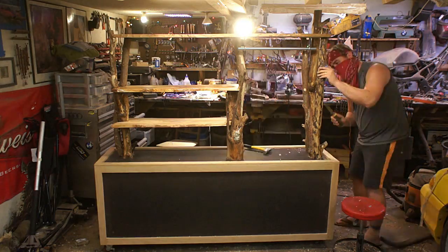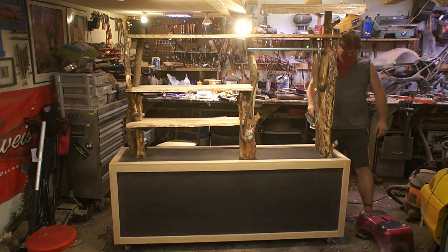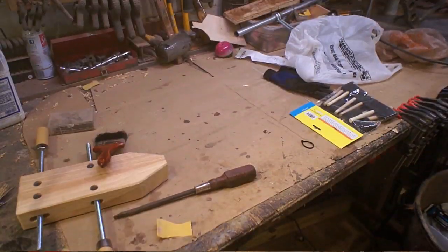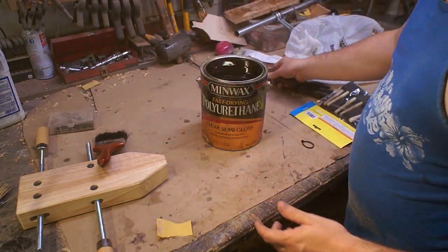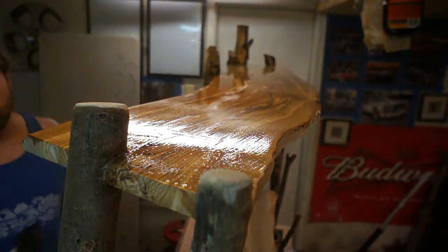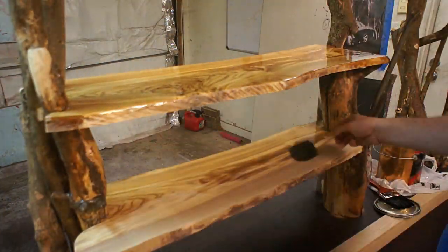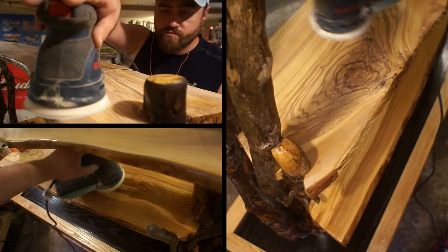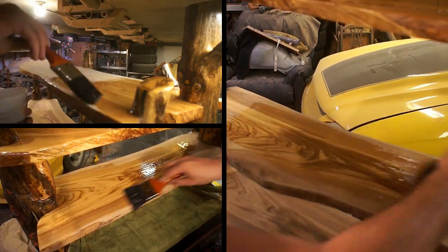I'm not exactly sure where the footage went, but I did go back and add some more supports in between all those uprights on the right-hand side — lost that archive somewhere. Coming back through, getting everything sanded down smooth and flat before applying some finish. I'm using a typical semi-gloss polyurethane for the wood — I figured it would hide smudges a little better. After the first coats were done I sanded everything back down to rough it up so the next coats would stick. I did about three or four coats total just to make sure it was all protected and would hold up well.